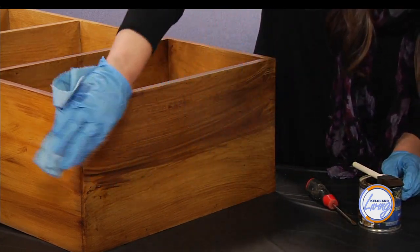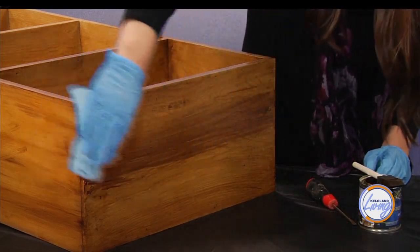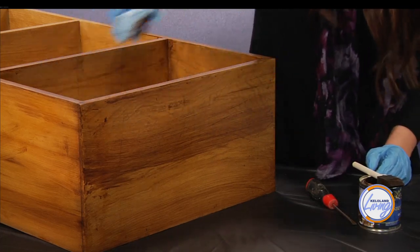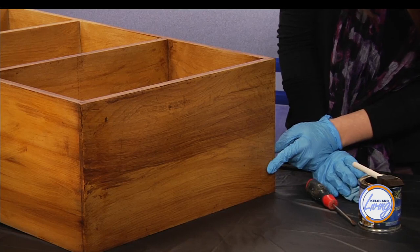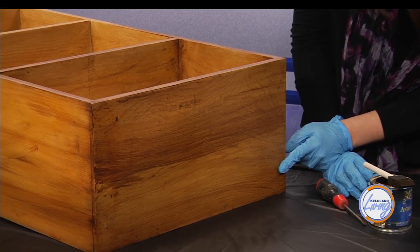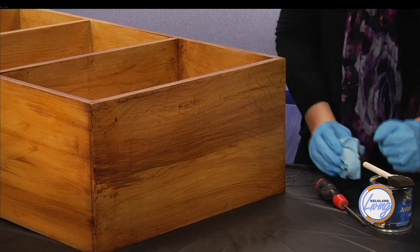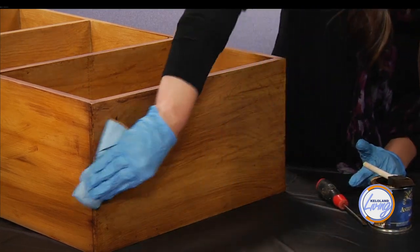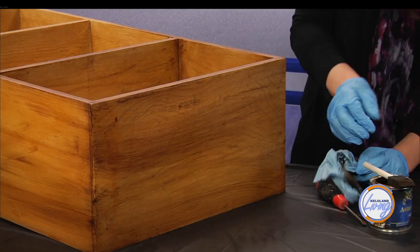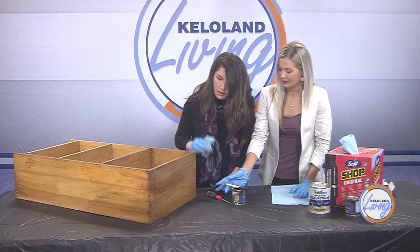You can see how it's just a little bit darker — this is one you're going to layer. Because it is a translucent stain, you may need four or five coats on a lighter piece like this. It does get a little tacky or sticky, so you want to let it dry between layers. Keep working with it and working the stain into the wood — you're actually wiping it completely each time.